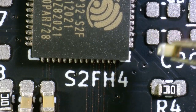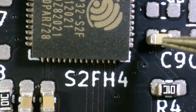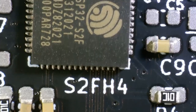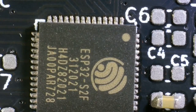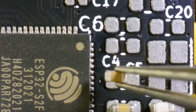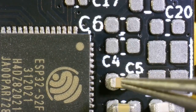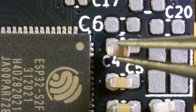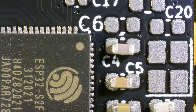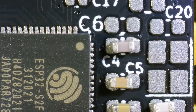I got into designing and assembling my own PCBs some time ago. I invested in a reflow oven relatively early on since I knew I wanted to use more challenging components like very small SMD caps and resistors, fine pitched ICs and BGA packages. One step that I always found challenging is applying the solder paste using the manufactured stencil.